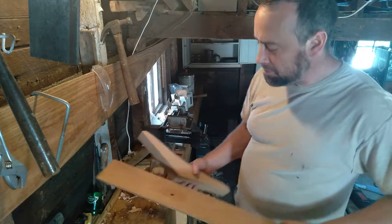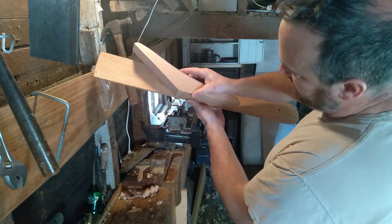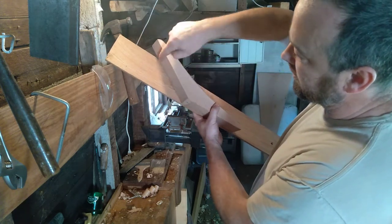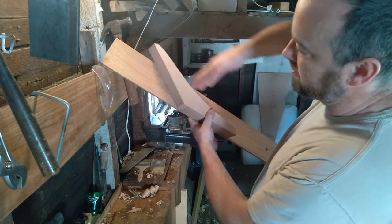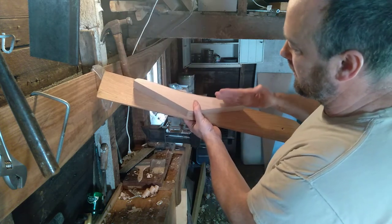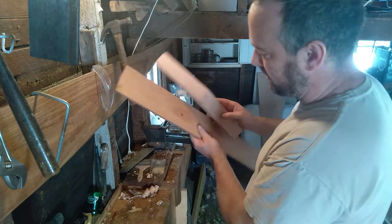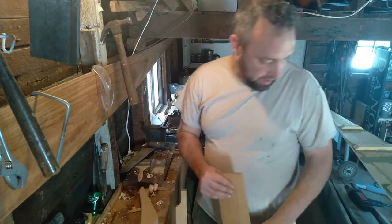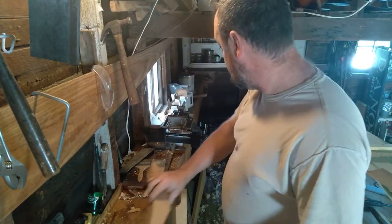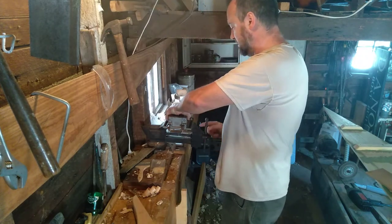Whenever you're doing something like that, some people will just throw the pattern on there. They figure, oh, I'll use this straight edge and then cut the rest out, but you end up with grain going across your knee. So what you want to do is put the pattern on a diagonal to the wood you're using and try to follow the grain with the pattern, and you'll get a stronger knee out of it. Anyway, that's just the thinking when laying out the pattern pieces.